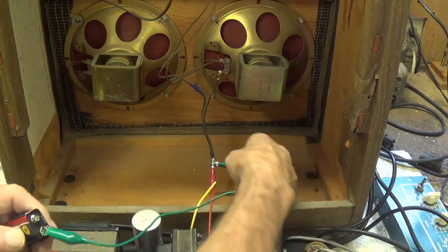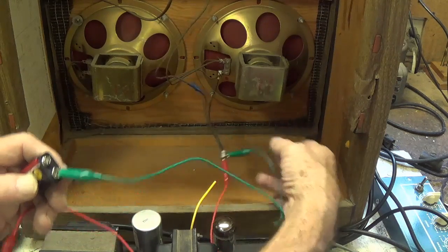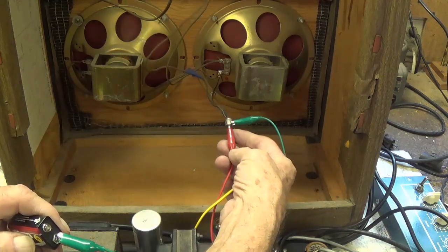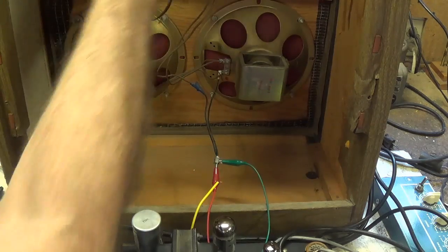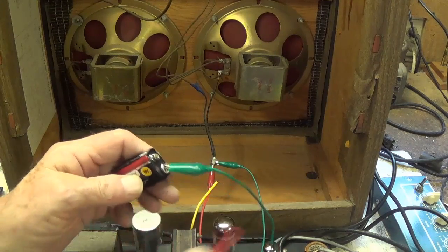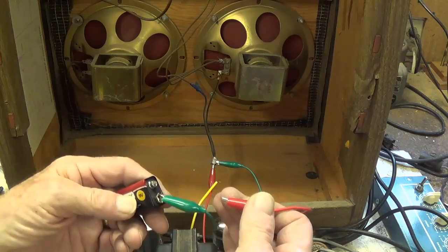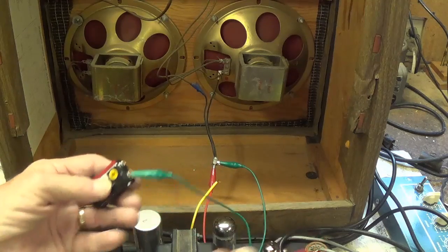Now, step one, on this type of speaker plug, there's an outside, what is normally a shield. I've connected a green jumper from it to the negative pole of a 9-volt battery. I connected a red jumper here to the tip of that speaker plug, which is connected to the terminals on the speaker that have red dots. Now, what I'm going to do is just touch the red jumper here to the positive pole of the battery. You hear the speakers react, but it's kind of hard to tell if the cones are moving in the right direction and if all four speakers are working.